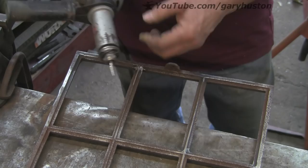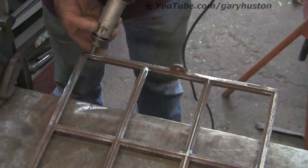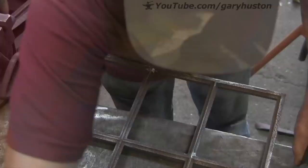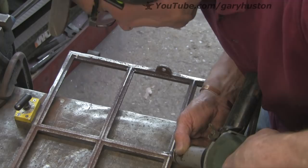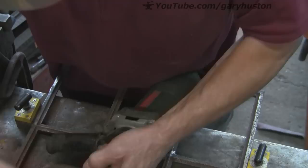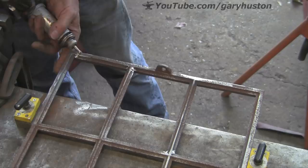I've got the die grinder - a tiny little bit in there. I just want to get into a couple more cracks because I haven't done right into the cracks that go into where the window glass goes. I don't really want to get too far into there - it just means you've got an awful lot of cleaning up to do so that you can get the glass in. To avoid the sections that the glass fits in, I'm just going to change the bit to a little tiny round one - give it more cleaning up, give it more gouging.